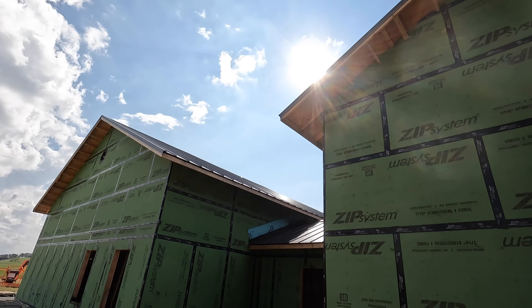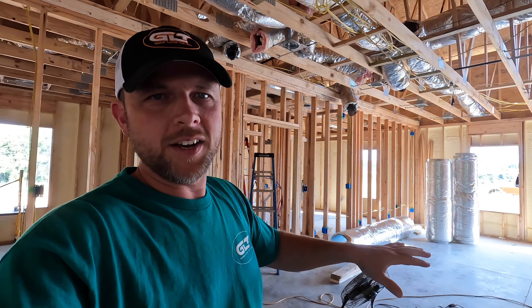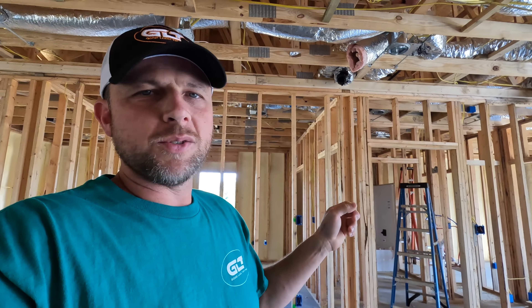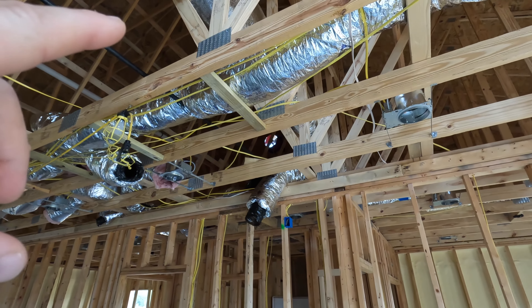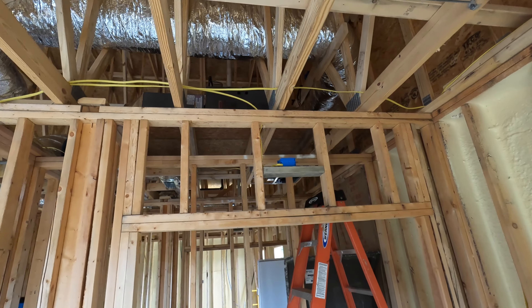I went ahead and taped over my holes in case we get any blowing rain. Both fans are mounted now. I tried a little experiment — since I don't have windows and doors in yet so everything's open, I wanted to check if with the fan on high it would still move the piece of plastic covering the hole out in the eave. It was a calm day with no wind, so the plastic wasn't moving on its own. I cut the fan on high speed and you could see it sucking a vacuum against that plastic up in the eave of the house, even with all this open space below. That thing will definitely move some air.